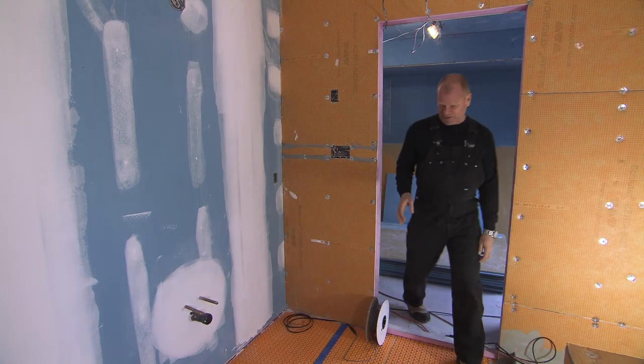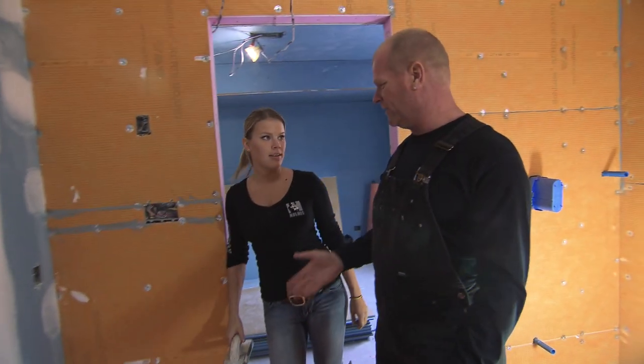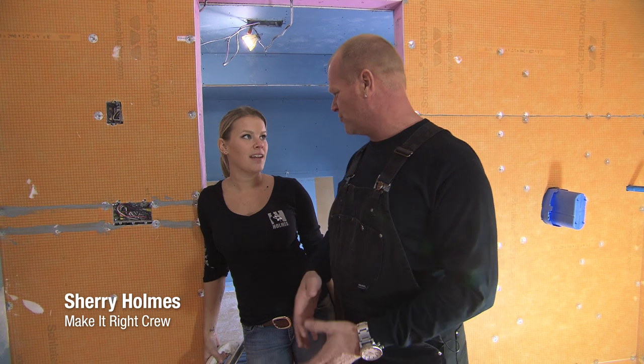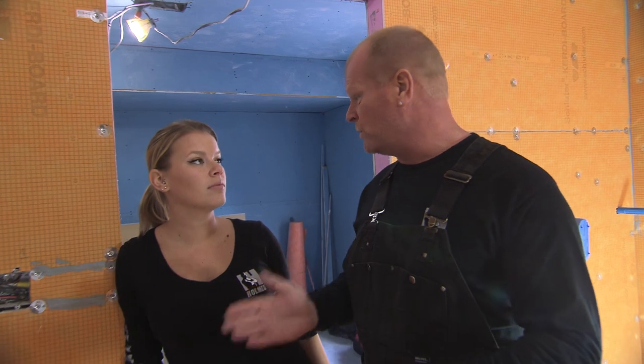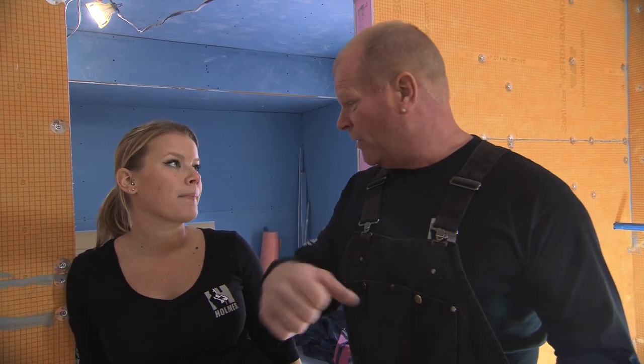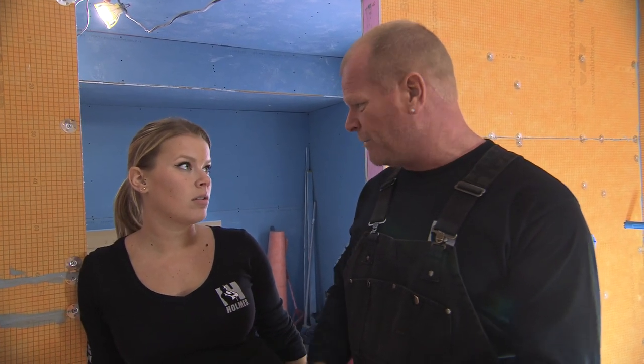You're gonna love this, Sherry. How many times have you installed Ditra? Over and over again. Ditra Heat obviously makes sense — we're gonna add cable, and it just wipes out that secondary system. We always used the mats, which had to be pre-ordered and took some time. Then we'd thinset that down and wait before tiling. This is so simple — the heat cable just gets snapped down into the pucks.